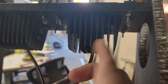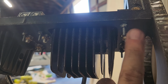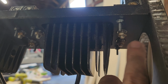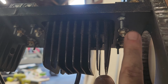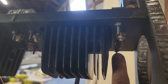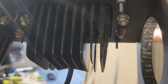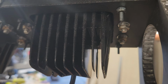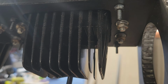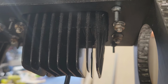They probably do, but instead of that, what I plan to do is just make a flat piece that has all of these holes made in it in the 3D print, and just use the same material as this is made out of, and just have it held on by these, and then it holds these nuts secure. So I think I will put some epoxy in where those nuts are, very lightly, just to hold them in place. So if I do ever have to screw them on, they'll stay exactly where they are.